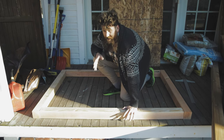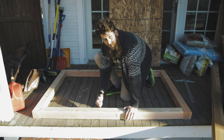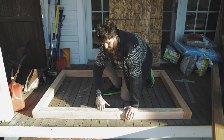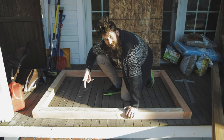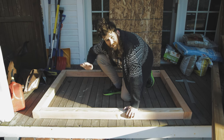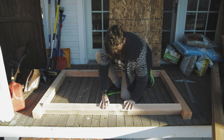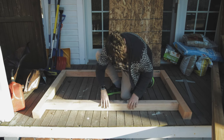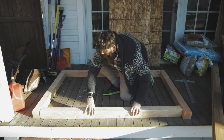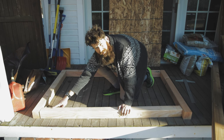This is another good point — you can hide some rough spots like I mentioned, because the face that the tabletop is going to sit on top of will be permanently hidden. So roll your boards over and see if you have any rough spots on any of the sides, and if you do, just mount the tabletop to that side and you've completely hidden that rough spot. You can see I've got this big gouge here on this one that's going to be completely hidden by the tabletop.